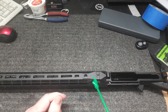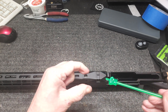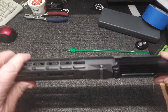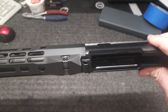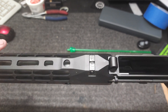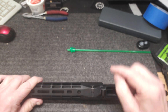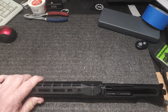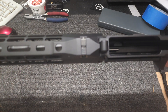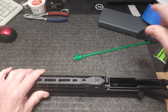Not only will it pull this tight, it'll pull these two into the lugs on the barrel nut. If you notice, right here you can see that it's below flush on both sides — that was not so before. And right here you'll see that it's very centered. Typically you will not see that if it's not timed right.